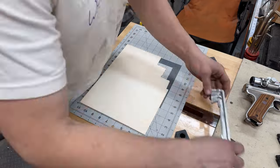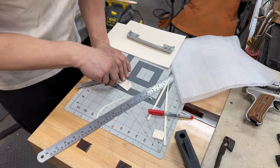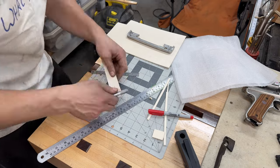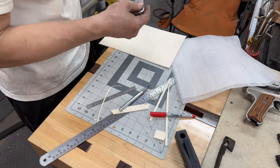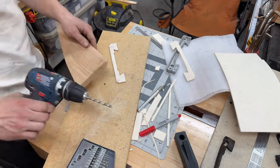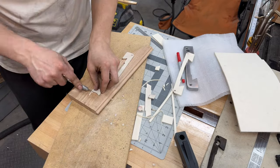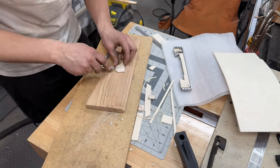The felt I'm using is called hard felt. It is 100% wool and very expensive. This machine uses 3 different thicknesses of felt: however, they are all fractional divisions of 1/8 inch. So I simply purchased 1/8 inch thick sheets and stacked them to get the thickness I needed. They're going to be held in place by covers anyway, so it doesn't matter if I use multiple layers to get the thickness that I need.